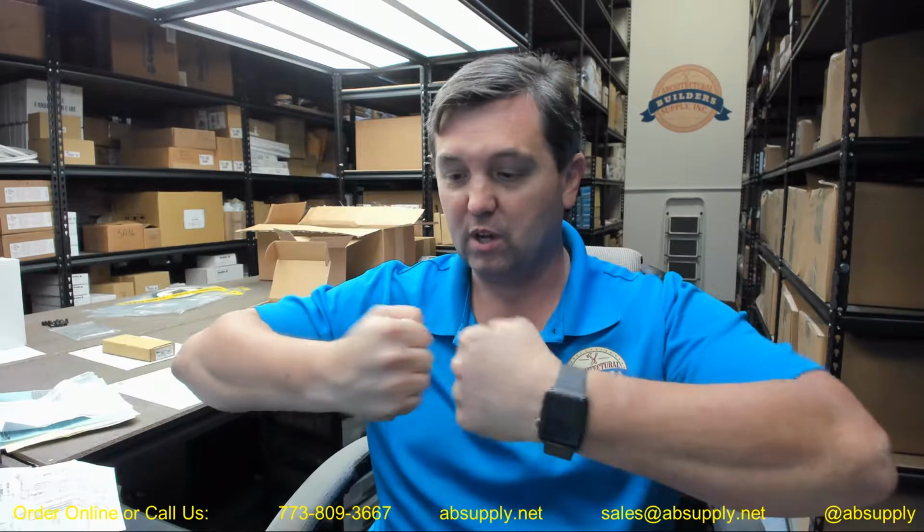I've seen these installed in active doors as well, when someone was literally trying to pull both doors closed, and not a 790 but a 780. I've seen them mortised directly into the face of the doors so that they could pull the doors closed and then latch both of the doors closed. Obviously, that was not a path of emergency exit. So a 790 is a flush bolt that is used on wood doors.